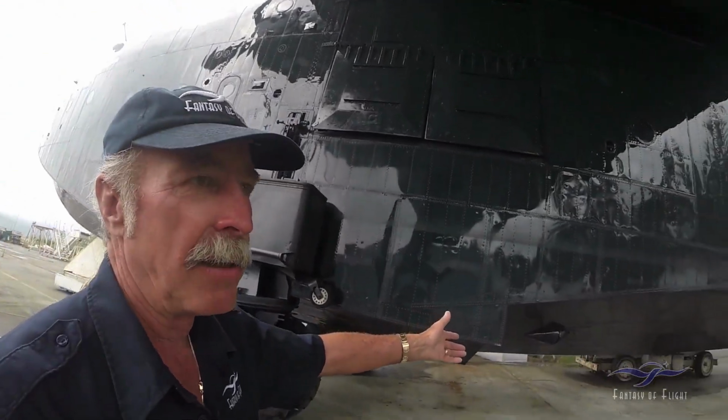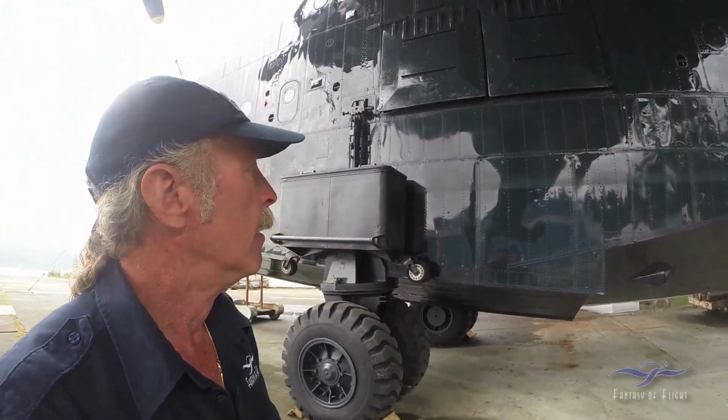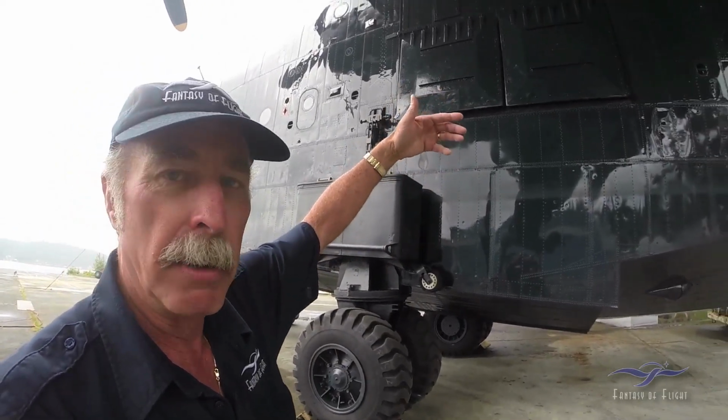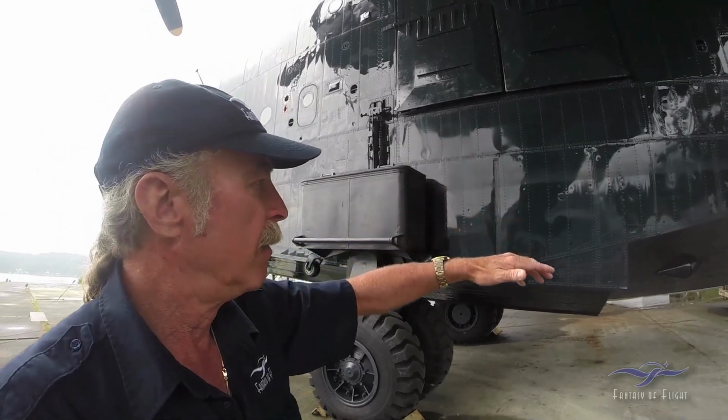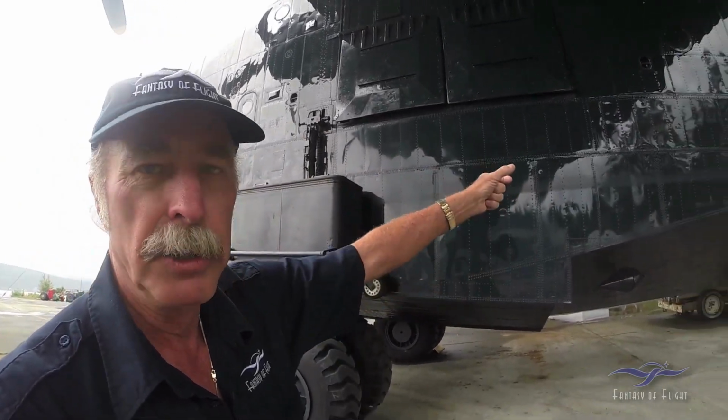Otherwise, it's going to rip the probe off, potentially. If you go too fast, I think at 80 knots, the probe's designed to actually bust off the airplane. And of course, the tanks are basically, in this airplane, above the water line. So even if you have a leak in the probe, it's not that critical, because all you can do is fill up a little tube of water.